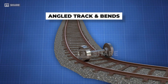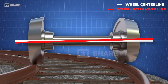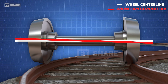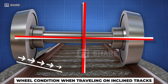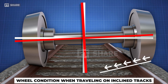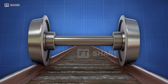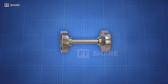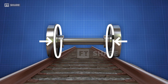So what about the sloping tracks that cause the wheels to move to the right or left? Something pretty interesting happens with train wheels when they move along the axis. It's pretty clear from this picture that the whole set of train wheels will tilt. This tilt also affects the normal force. Looking at the forces in this situation, we can see there will be a force pointing to the left, or towards the inside of the track. This force automatically brings the wheels back to the center of the track. As the wheels get closer to the center, this self-aligning force will start to fade away. To make sure the wheels are safe, flanges are added to both sides of the wheel. Cylindrical wheels don't have a balancing point like conical wheels, so attaching flanges to them still makes them less perfect on the tracks.